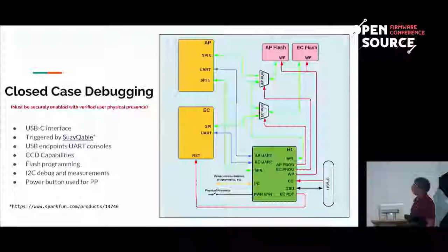There is also an I2C interface which in certain cases is used for programming flash on some ECs, and also for power management when the device is still in development. This power management hardware is not populated on production devices, but it is very helpful when the device is being debugged. This is what makes this chip very useful for Chrome OS because in newer designs, some are glued shut so one can't open them to remove the write-protect screw, but we still want them to be accessible to users.